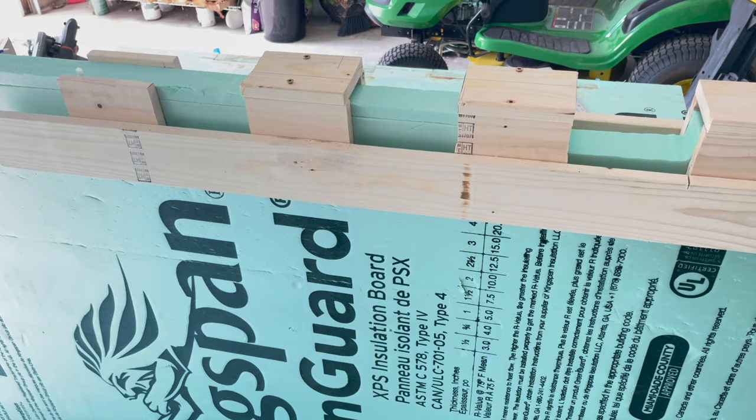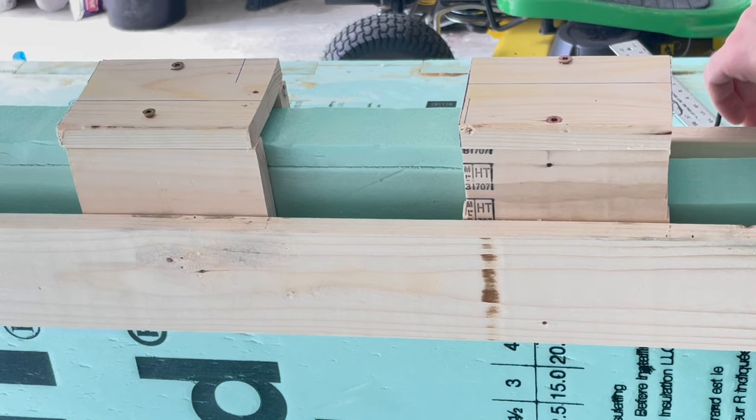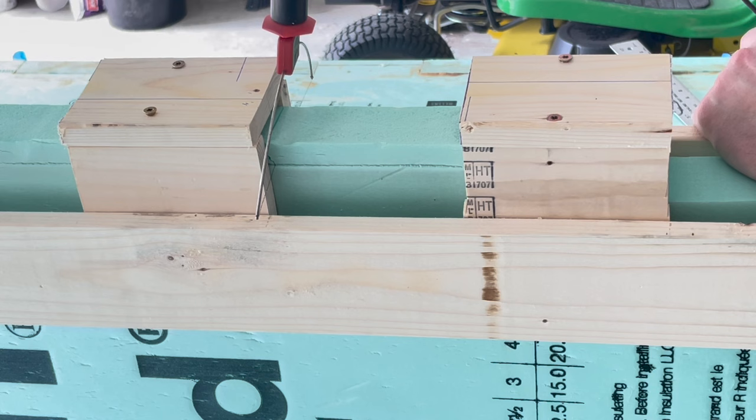And then after I reversed it, did the exact same thing, and then on the corresponding pieces I just offset it by one so that they would all interlock. So basically on that method you have 3 points of contact that you can epoxy to the other board or glue it with the other board.